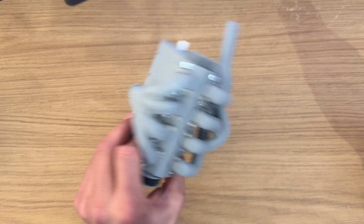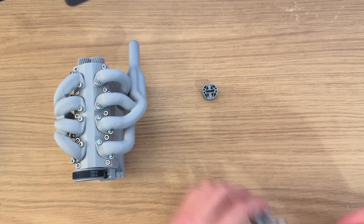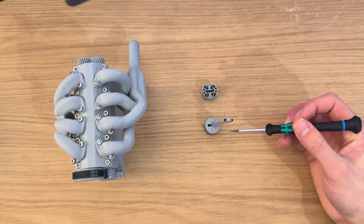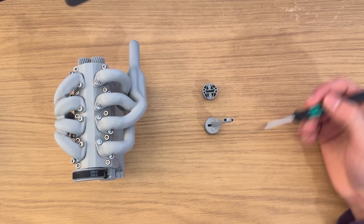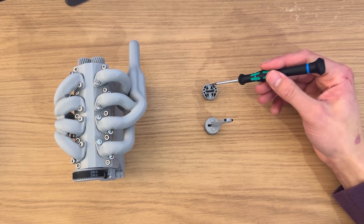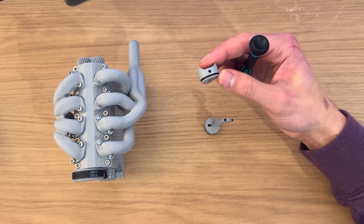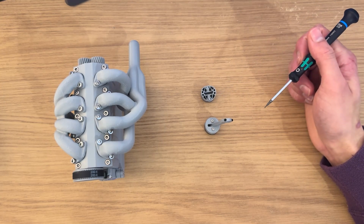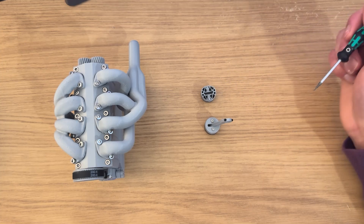Another improvement is in the pistons. This is the older piston with the connecting rod still attached. On the old piston, the piston pin is retained by two M2 screws, whereas on the new piston the piston pin is simply press fit within the piston. I've also designed a structure that saves weight, and it forgoes the top of the piston, also saving weight.